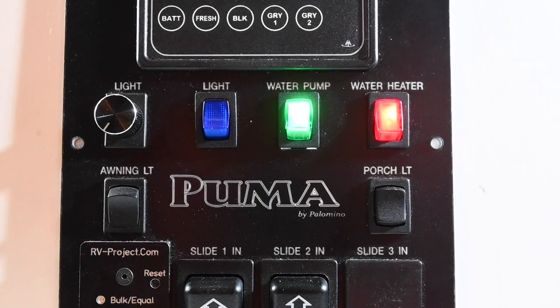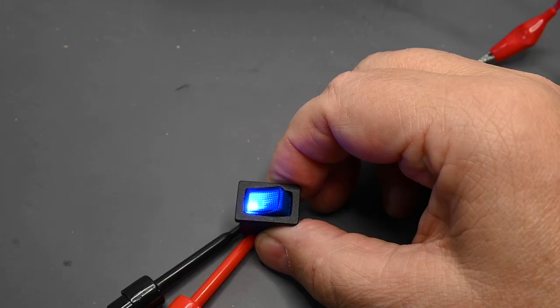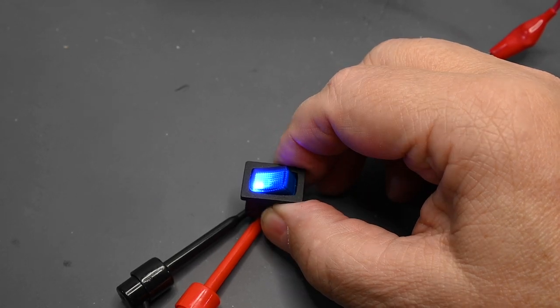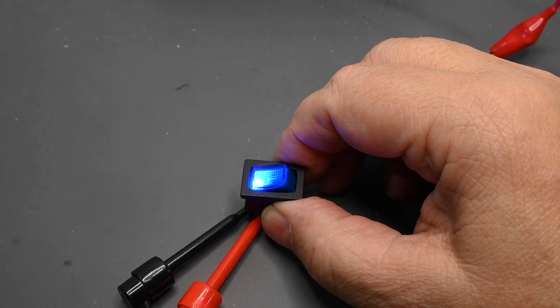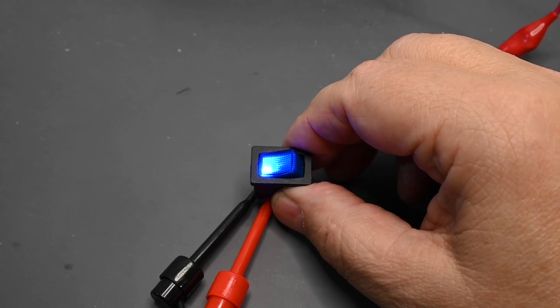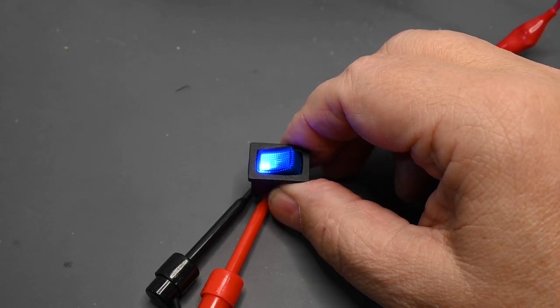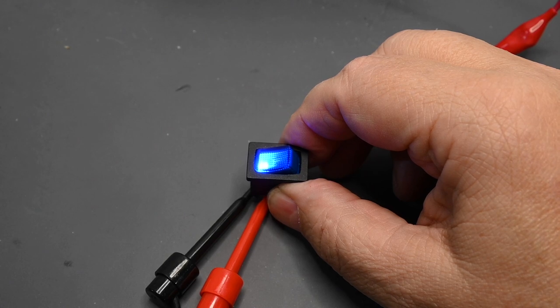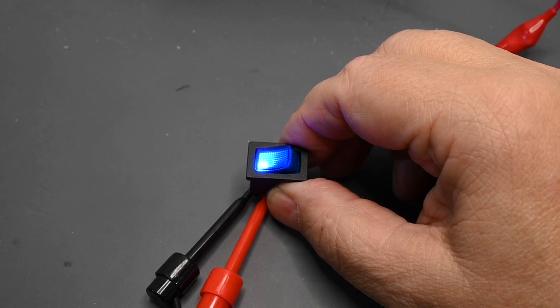Finally, you can dim the lights, and that's an interesting procedure. You can dim the intensity of the LED by inserting a resistor on the ground lead of the switch. Unfortunately, there is not a lot of data to help select the resistor size, as the switch manufacturer's datasheet won't specify what kind of LED is used. LEDs used for indicators typically require 10 to 20 milliamps for full brightness, so the proper resistor will be somewhere in the 1K to 10K ohm range.